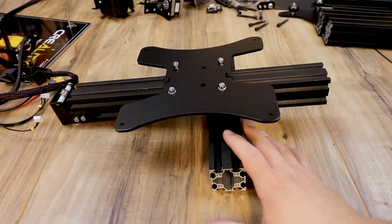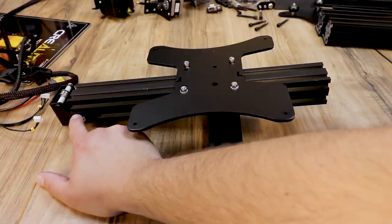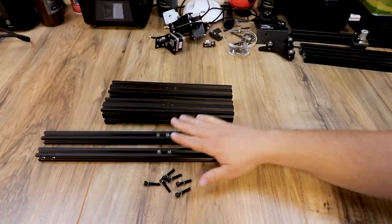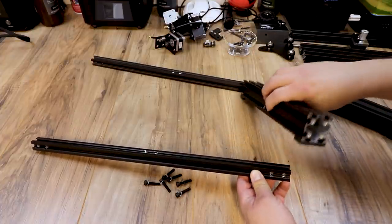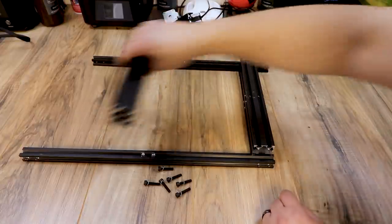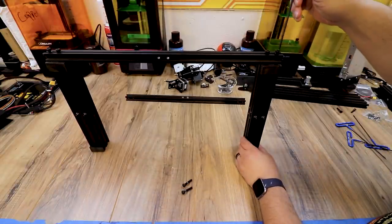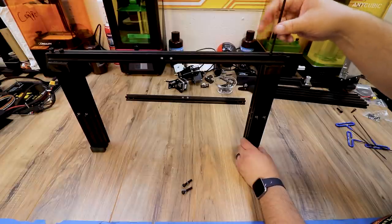That leaves this carriage in one piece and according to the instructions, we're completely done tearing down. The instructions don't ask us to take the carriage or the tensioner off yet, so now we're on to the assembly. Grab six M5 by 20 bolts from the kit, the two 2020 extrusions that are the long ones, and the two legs we took off before. We're gonna take our legs and put them between our 2020 extrusions with the beveled edge here going into the bottom holes on the Ender 3 Pro. The best way is to stand up your legs, hand tighten the four screws, then finish tightening with your Allen wrench.